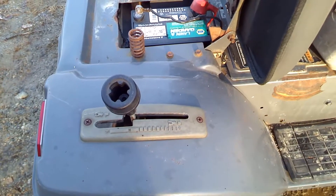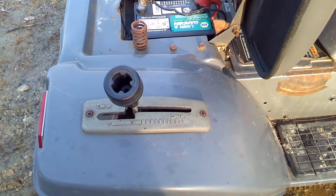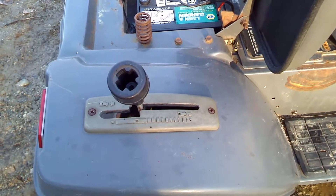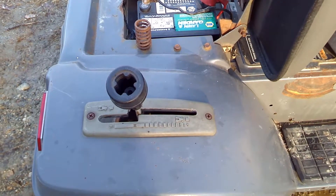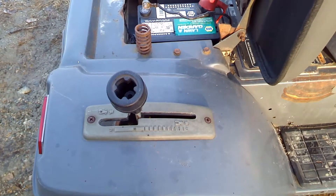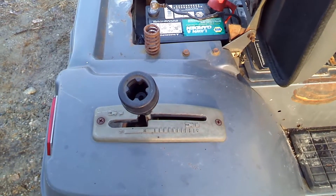You really want to be able to back out of whatever you get into. I made sure I had at least full power backing out. You want full power both ways, but as the linkages wear, you're going to run out of stroke on this lever. I've tried to correct every one of them, but they were so borderline to begin with that you can easily lose the full range of power on your hydrostatic transmission just because of the lever and linkages.